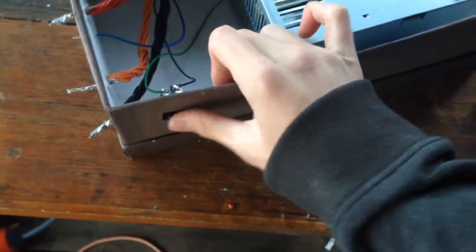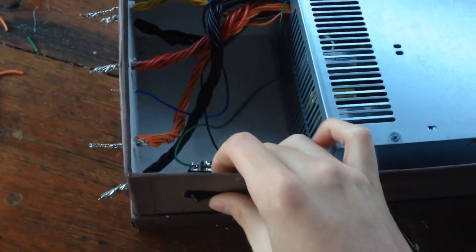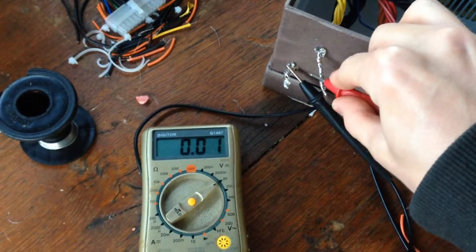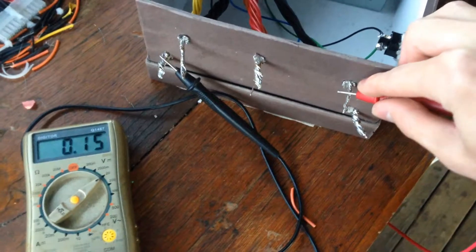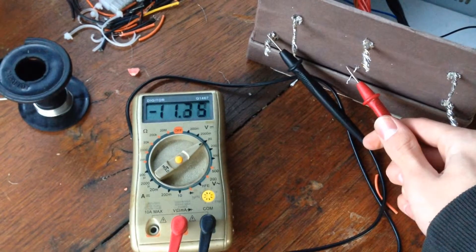The switch is soldered in — that should work alright. We'll plug it in, switch it on, and hopefully everything will work. Everything seems to be going well; you probably can't hear it but that fan is definitely turning. We'll check all our voltages — I've got the negative lead of my multimeter resting on the zero volt pin. This should be 12 volts here — yep, that's 12 volts. 5 volts — yep, that's got it. 3.3 — again, that's all good. This one should also be zero — yep, that's good as well. And this should be negative 12 volts — there we are, perfect.